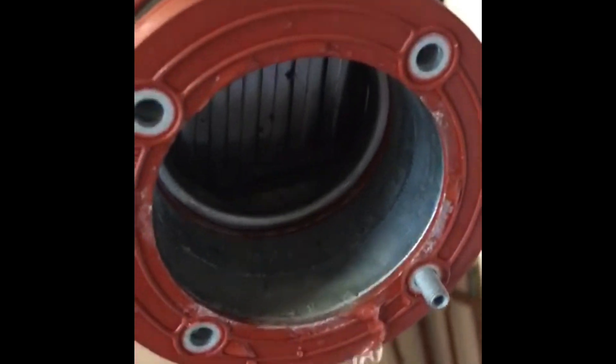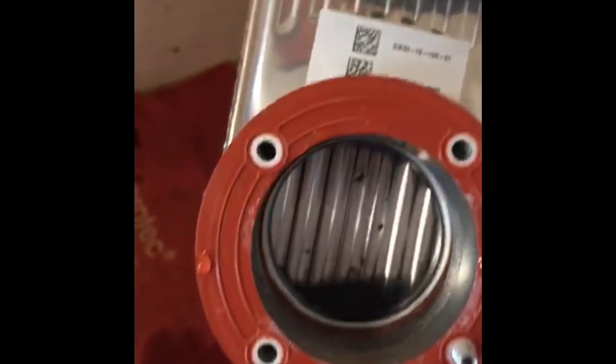If we have a look on the burner door here it's all soaking wet, and all inside the boiler is soaking wet. You can see a water line inside the heat exchanger. As you can see, something as simple as not connecting the condensate correctly can cause a lot of damage.